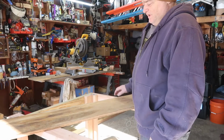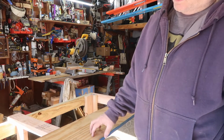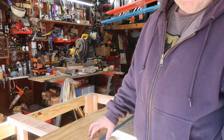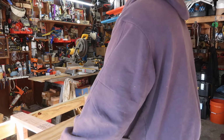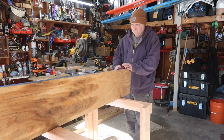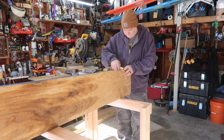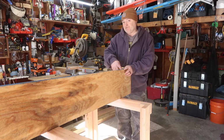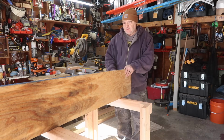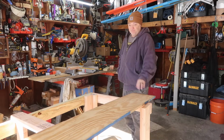Right, so this is a good piece of 3/4 inch, and I'm going to use this for the base of the miter box, or the miter saw will sit on this. I think it's thick enough. Take a measurement on it. Just under 3/4, 1/16 under 3/4. So I'll work with that since we're doing it out of scrap wood.